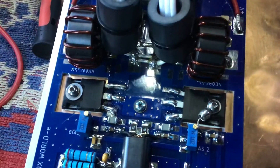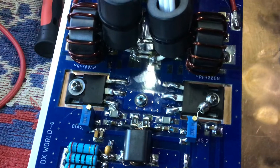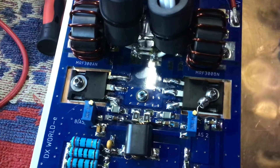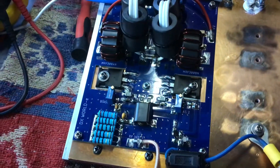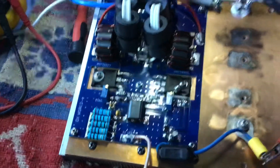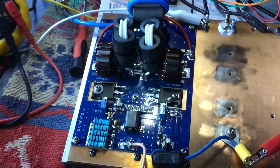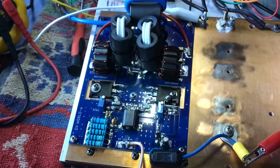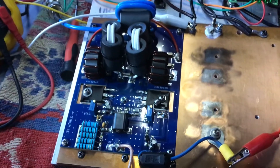You've got an A and a B version as you can see. The B is about $77 from Element 14 and the A is about $68 roughly last time I checked. So if you talk about $161 and about $140 for the parts, it makes a relatively cost-effective 600-watt board. After the filter you'll easily make your 500 watts, so this is a good Australian legal limit board with a little bit of headroom.